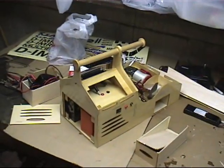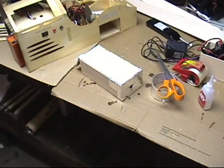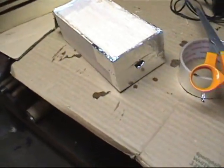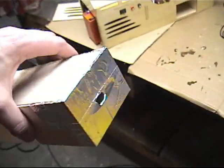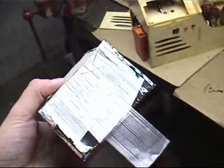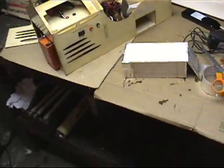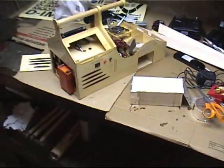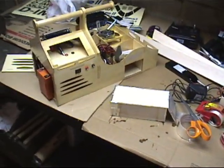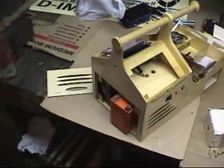That is the tote. I'll modify this box so it can be charging LiPo safely indoors and outdoors. Here's the final product of the LiPo safe storage and charging container — I've made a hole in the front to let the charge lead come through. The inside is completely insulated with 600-degree tin flue tape. The key to remember with LiPo batteries: always charge them in a fire safe device, even at 1C, especially indoors. Never charge LiPos in a vehicle — always use a cigarette lighter adapter to the outside of the vehicle, or connect to your car's battery, or use an e-tote such as this one with its own onboard battery.